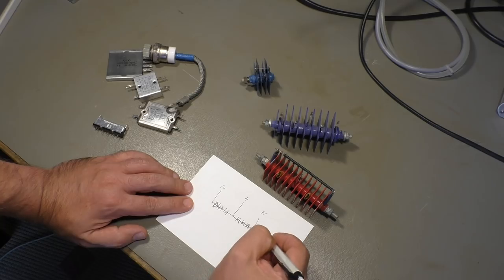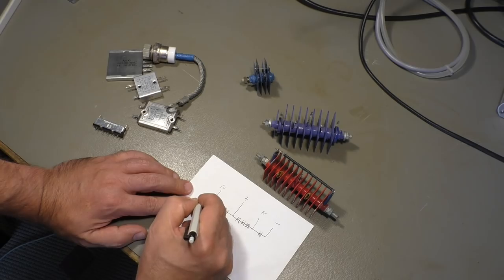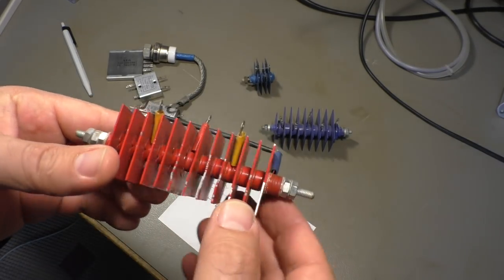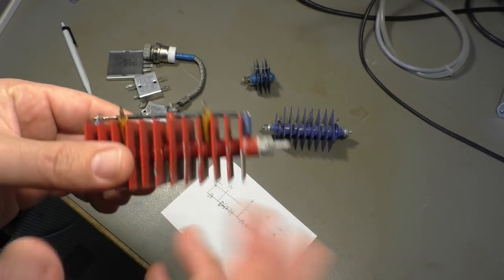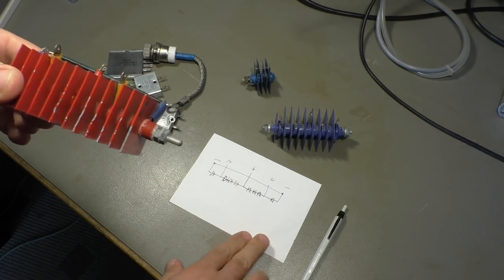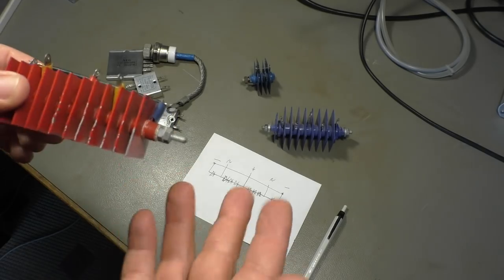I only draw one diode now. It's also 3, of course, minus, like that one, minus, with a connection between. That's our rectifier. And we can say from the number of diodes that are used, 1, 2, 3 in series, that's about 75 volts, because it's around 25 to 30 volts per diode. So if you need a higher voltage, you just add some diodes in series.